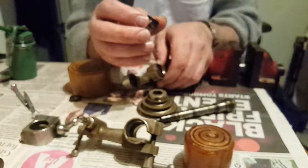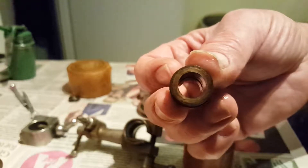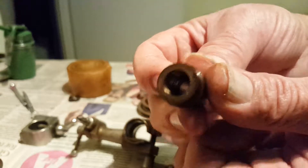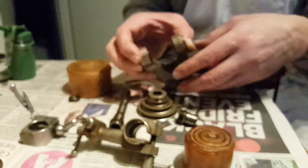There's the other part there. Remember, when you put it back together, you'll see the little locator pin — there you go, you just catch it on the side there. That lines up with that keyway. Don't forget to do that. You'll know if it's not when you start to put it on. And that's how you disassemble it.